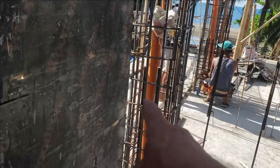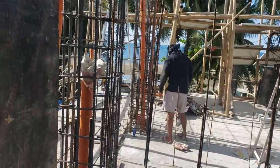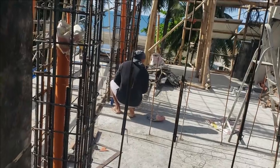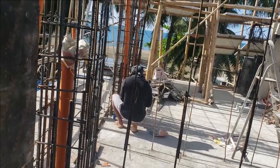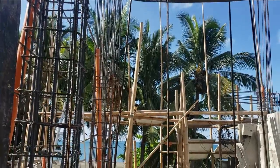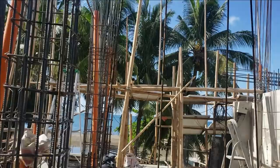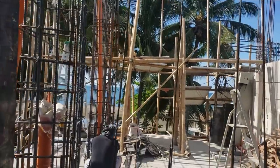Some of these are roof drains. A roof drain, and one down there's a roof drain, that one over there's a roof drain. But that particular one is a sewer drain. It does not drain the roof. That's going directly to the sewage. That's the one we have hooked up, so that if we ever want to have a small CR up on the roof deck or anything up there that we need to drain to the septic, that's our access point into it. And as well, it's currently working as a vent stack.